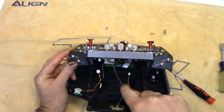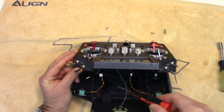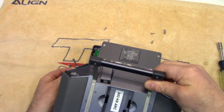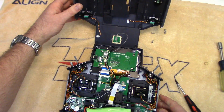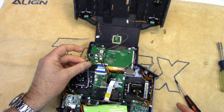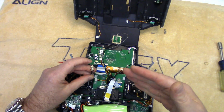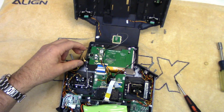Now the GPS antenna lead is here. And that antenna we had unscrewed — there it is right there. The reason I do that is because when we open this up we're going to have to flip this around. There's the GPS antenna lead, and I just like putting the radio down like this and then flipping the backside around like that, so we don't have any strain on the antenna. As you can see, there's the external antenna lead. By taking it out, we didn't have to unplug the UFL connector right here. UFL connectors have a finite cycle life, so if at all possible you don't want to be pulling them on and off too many times.